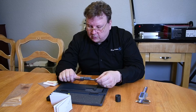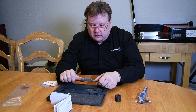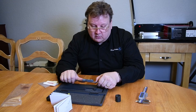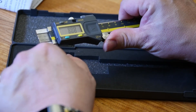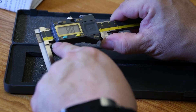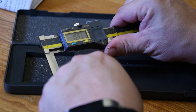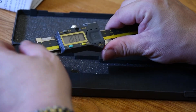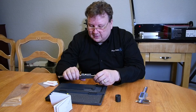If your battery went dead and you don't have a spare, you can still get a rough measurement just by the scale. Go back to zero where the points are touching each other and you can see it's also on zero on the scale. It'll get you within a millimeter or so, so if you're really in a bind you can still use it.